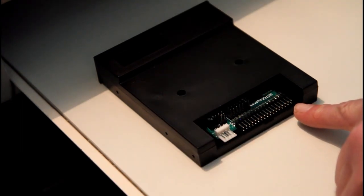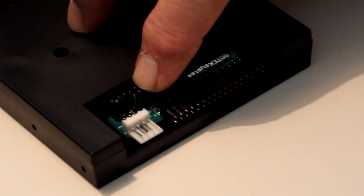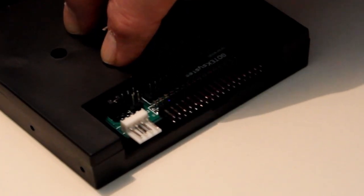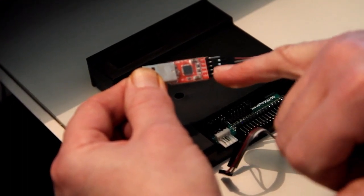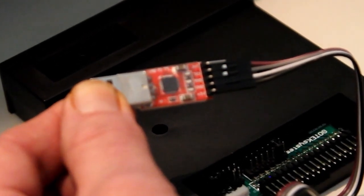We don't use the standard floppy drive cable — that goes into your actual device when you've finally installed it. You can see these two pins: put a jumper across the reset pin, and there's the receive and transmit pin with a jumper across those two pins to enable programming. On the serial adapter we've got 5 volts, ground, receive, transmit, and a spare pin for 3.3 volts output.